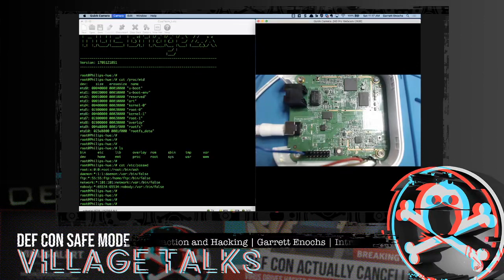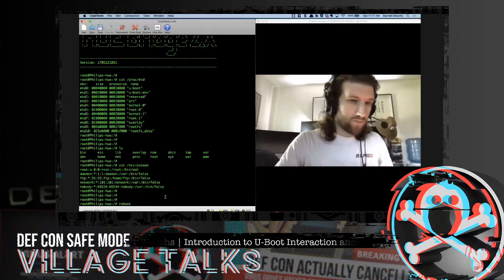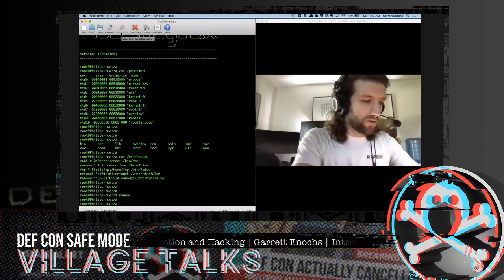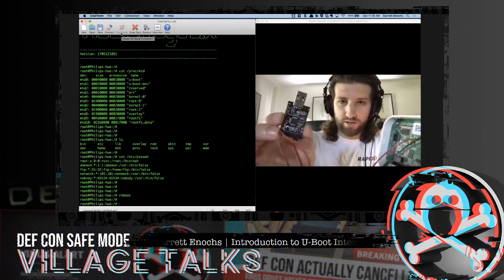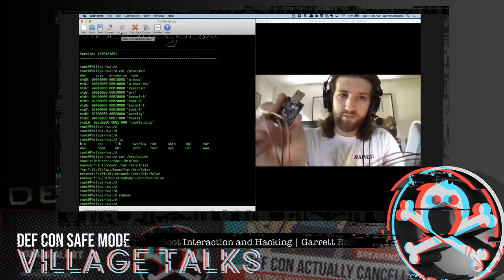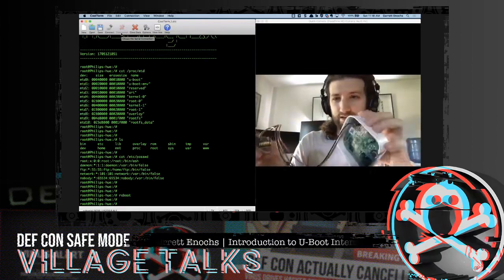Yeah, let me show you. I can show you what that is here. We got one right here to show you. So let me kill out this thing real quick. We're going to disconnect and pull this thing right out of my laptop for you. Pull power. All right. So to give you a better idea of what this thing is, it's basically just a little USB with a chip attached to it with several different header connections on it. It comes with a data sheet that breaks down what these connectors are. But that's literally all it is. It has three cables, one for ground, one for receive and one for transmit. So that's how I'm connected directly to this device.